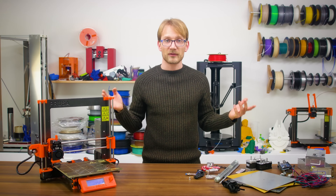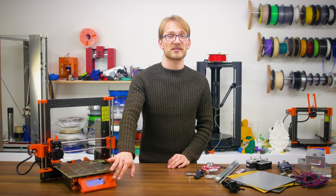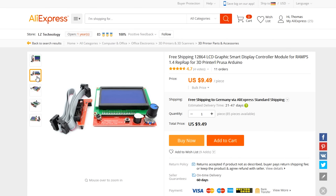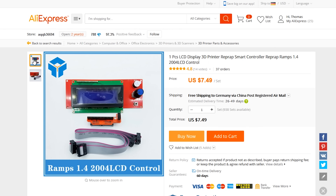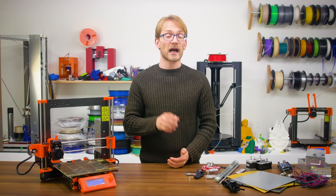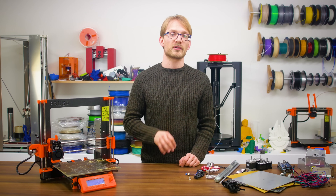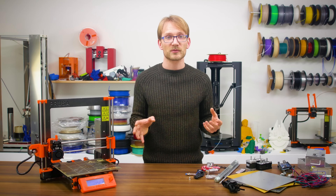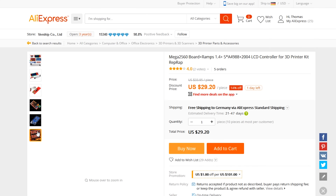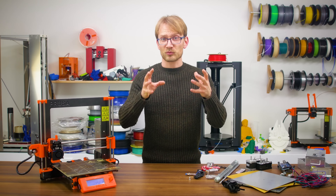That should have the electronic parts pretty much covered for now. You're free to add an LCD controller to the setup — we will actually configure the firmware to work with or without the LCD. You can go with either the larger pixel-based displays for around 10 bucks or the faster but smaller character-based ones for a bit under 8 dollars. I'll be making a firmware configuration for either one, just make sure you get one that does include the adapter for the RAMPS. You might also be able to find package deals with an Arduino clone, a RAMPS, drivers, end-stops, wires, and the LCD, but they're not always cheaper than buying everything individually and hunting for the best price for each component.